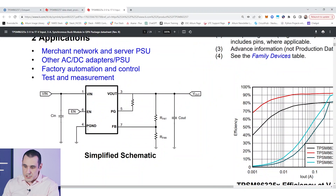Take a look at the application circuit in the datasheet for this regulator. This application circuit doesn't even have separate grounds — all of the grounds are a continuous plane. You could use a net tie to partially separate return currents on the output side from the input side if you want to, but frankly a lot of times you really don't even need to do that.